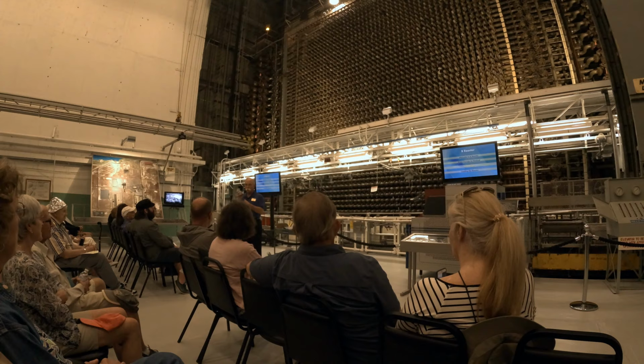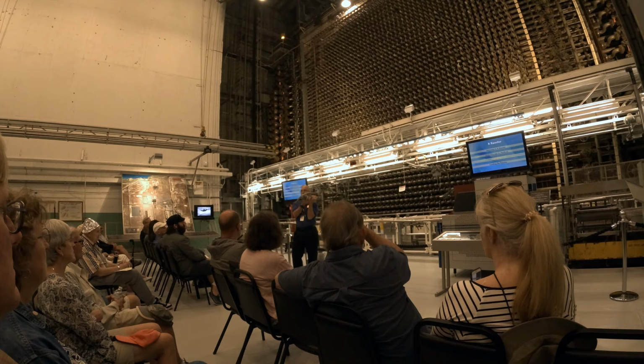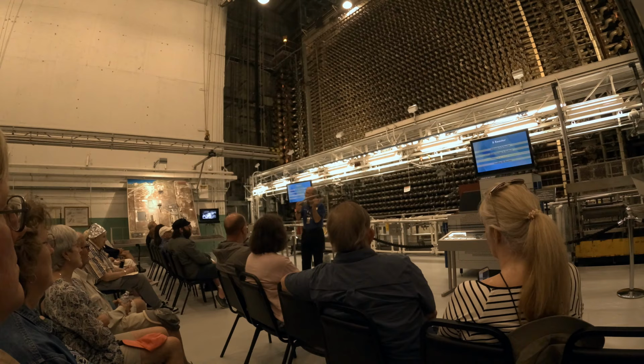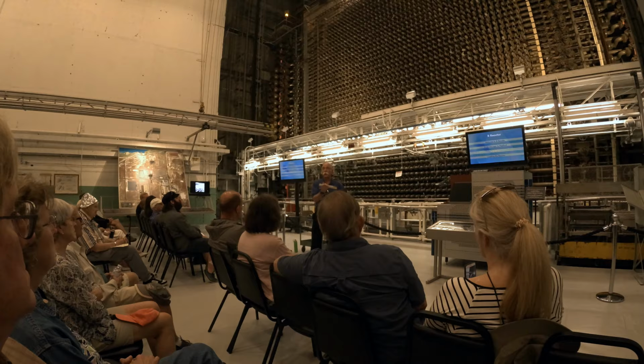Now these process tubes, what you're seeing is the closure system for the process tube. So behind each one of these nozzles, that's where our process tube makes up to. And it has two entry points, one for water cooling flow, and one to be able to put fuel in. Now on the back side of the reactor, it looks exactly the same. So when it comes time to replace the fuel in that process tube, we take the nozzle off of both ends, the cap, we feed in from the front, the old material falls out the back.